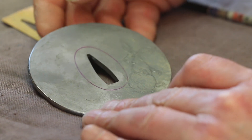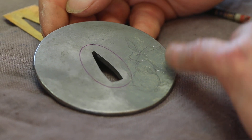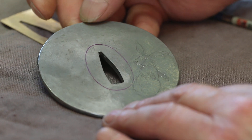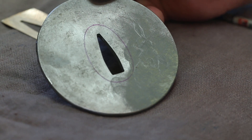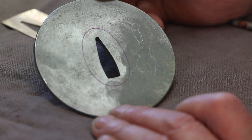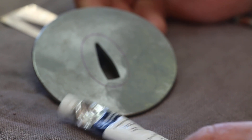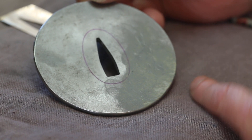The other side of this piece is a little rabbit. I did a few studies and we came up with this composition. The rabbit's busy eating but is then captivated by the moon, which will be in the top left-hand corner, partly hidden by clouds. The idea is that the moon has captivated the rabbit so much that he's distracted from eating the clover. I drew the hare a few times and then sketched it directly on the tsuba. When drawing directly onto iron, I use Chinese white paint — a trick I got from Henry Spencer, the renowned New England chaser.